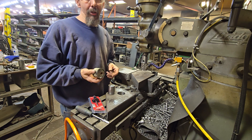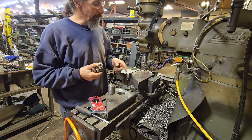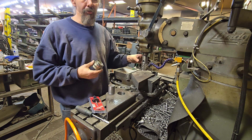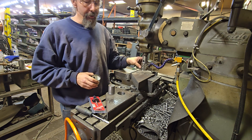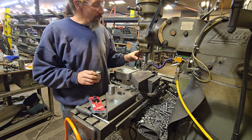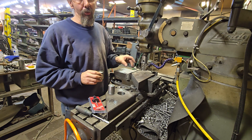Also, if you've got somebody that's careless with your tooling and you blow up the hole saw, you're out 12 bucks. This annular cutter is hardened steel and was about $200. In carbide it's about $400 to $450. So your price point makes a big difference. If you've got somebody in your shop that's not real careful, you don't want to run an annular cutter because you're going to be going through very expensive consumable.